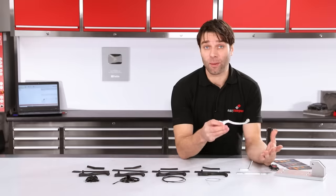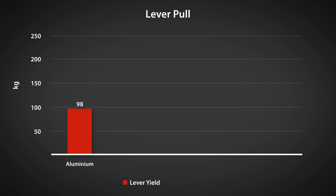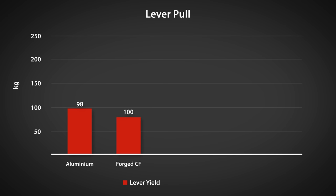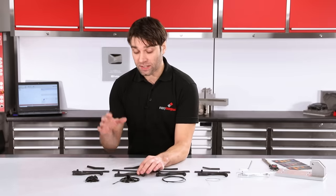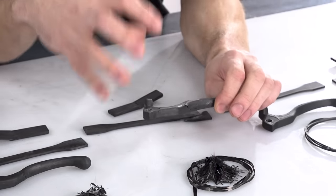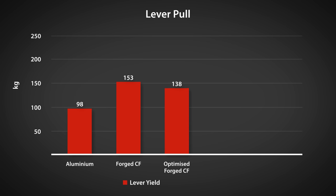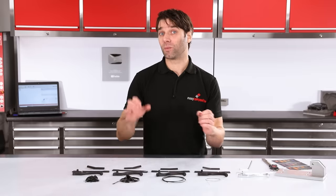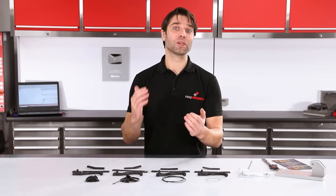With the mechanical testing done let's draw some conclusions. Starting with the lever pull test: the aluminium lever began to yield with 98kg of force applied. The conventional forged carbon lever — made with the exact same process shown in the previous video — failed at a much higher 153kg before it began to fracture. The optimised forged, with continuous fibres added in key areas, failed at a staggering 203kg. Both forged carbon levers outperform the aluminium on a size-for-size basis, and that doesn't even account for the fact that forged carbon weighs around half as much — so you'd be increasing strength while halving the weight.